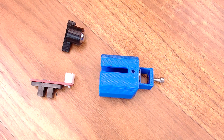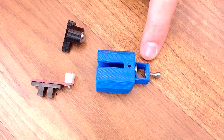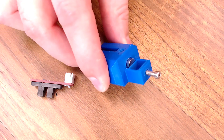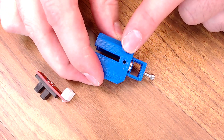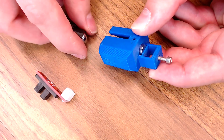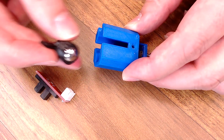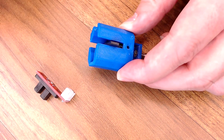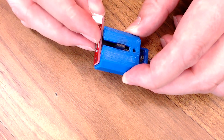Here's the design I came up with. This housing sets on top of the Prusa Mark II extruder design. This piece clamps on to the lever that you use to load filament in the idler. You have an 8mm by 3mm magnet back here. The filament path runs on top, and you have a cup where you have a steel ball that has a flag to trigger the sensor.